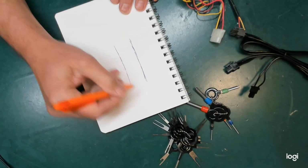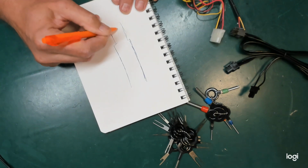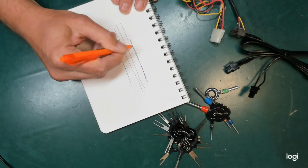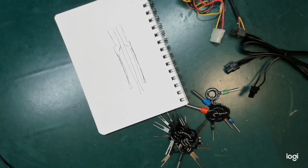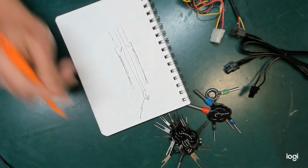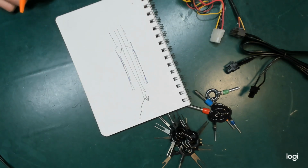So if this is a hole through the connector, and then the pin for the connector runs through the center, sorry, I've made a, I don't know, connector something like that, there'll be little snags on the sides of the pin that are designed to stop the pin from moving that way when it's plugged in. The wire's usually off here somewhere. Rough drawing. I didn't have the time to paint it or make it to scale, but that's the basic mechanics of it.